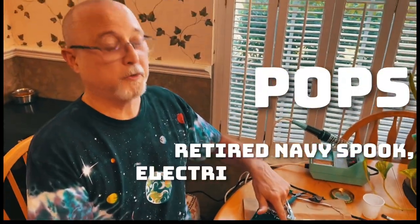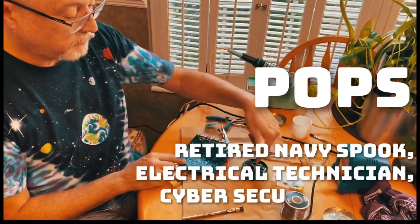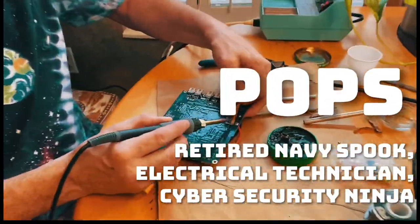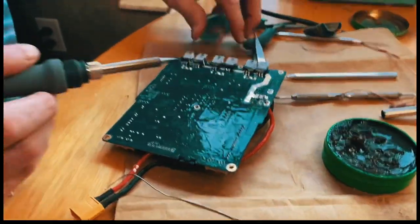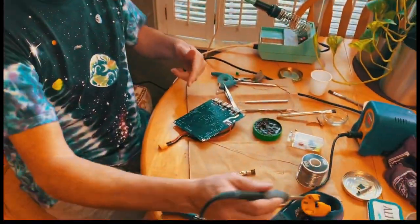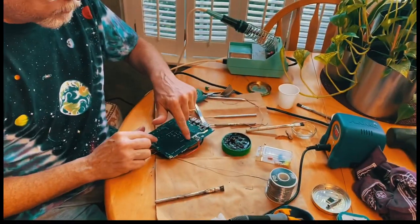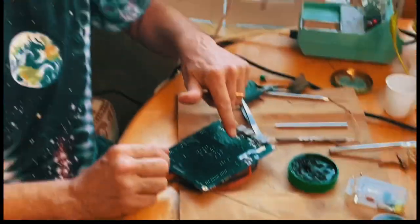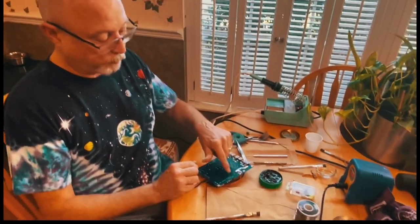You haven't burnt your circuit card at all, because that's the flux and the stuff that comes out of the braid that I'm using to suck the solder out of the holes. And this circuit card can take a lot more heat than this soldering iron can give. This will clean right up with isopropyl alcohol and a trimmed acid brush, and we'll show you in just a second.